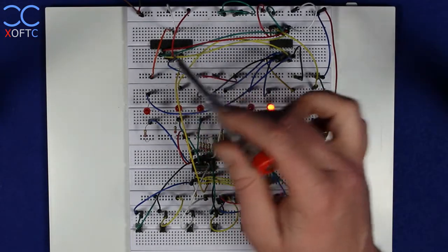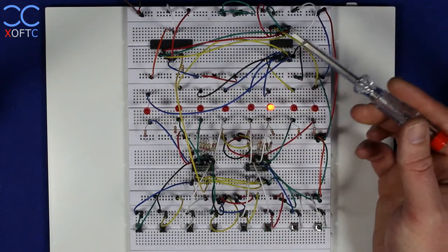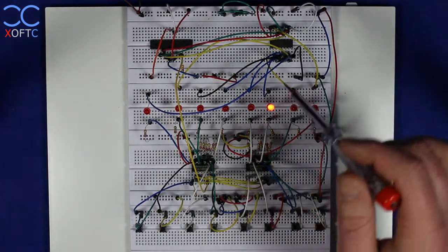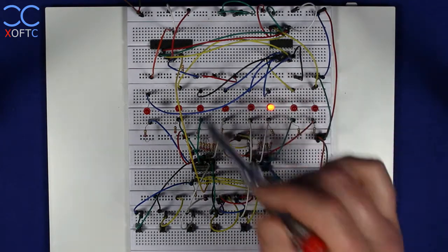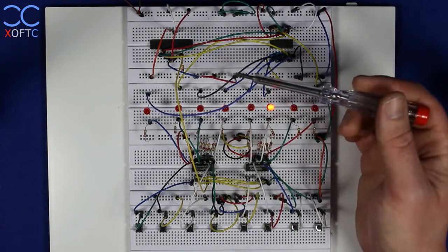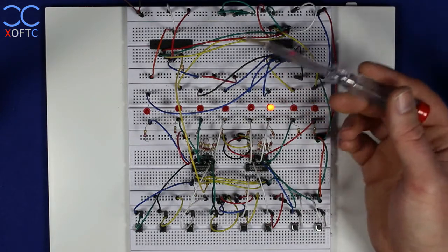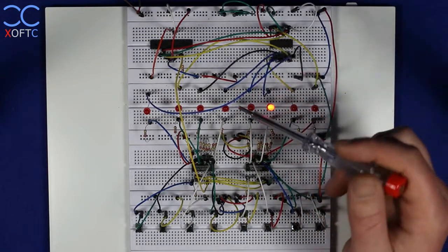So we have all the rest of the pins still available, where if we, for example, would just want to make the same functionality without all this extra complementary circuitry, then we would need to use probably most of the pins on the microcontroller, and anything else that we would want to add to this circuit, then we would already need to consider either a bigger microcontroller or just adding another one.